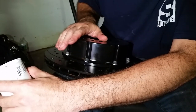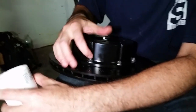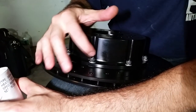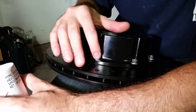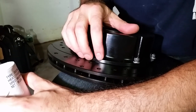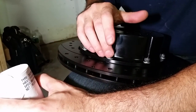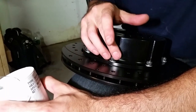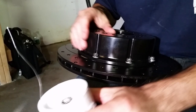The bolts that come with this particular rotor are non-aviation style. Aviation style safety bolts generally have a 90-degree hole from each other. These have straight-through holes, making it a little more difficult to wire tie. Unfortunately they're not machined very well, so when you torque them to specification they don't line up. We'll do the best we can.